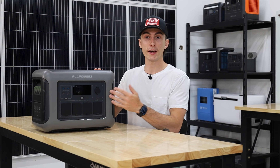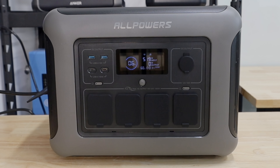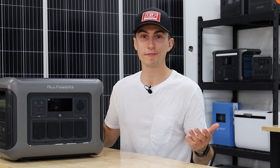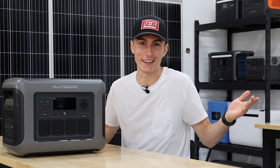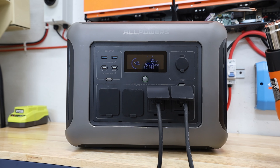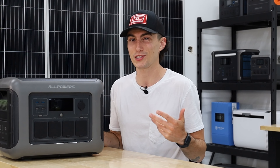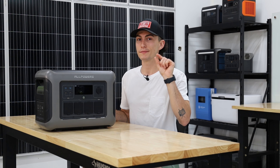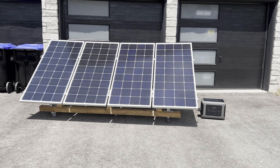Another surprise: when I plugged it back in to recharge, I found it had overheated again — even at the smaller load. Same day, same garage temperature, I was wearing pants, it wasn't hot. I don't know what to tell you. Moving on to surge: it says it's rated for 1800 watts. I ran an 1850-watt load and it ran for over a minute, which was pretty impressive. But as soon as you try to spike it to 3000 watts, it just shuts off. It doesn't surge well at all — a little bit yes, a lot no.